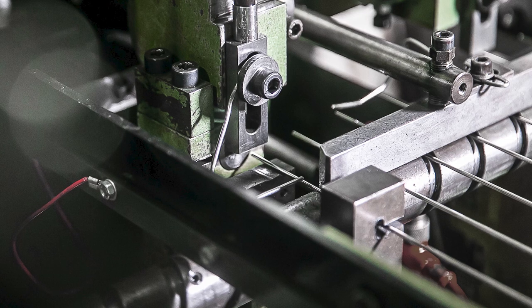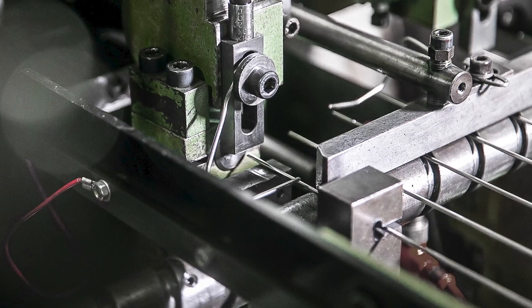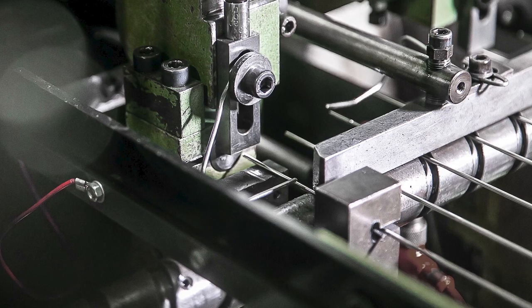And they even get a so-called fingerprint at the end. Yes, indeed — we can trace back any wheel. We can see who built it and with which spoke tension and which tolerances it left the company. The spokes are the connecting part in the wheel, combining all the single parts. All DT Swiss spokes are made of stainless steel with a specific alloy, and they are all manufactured at our own facilities using a unique cold forging process.